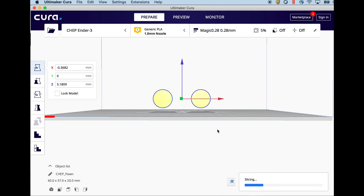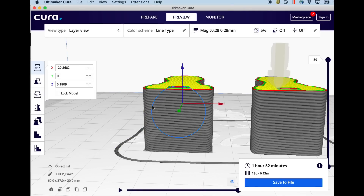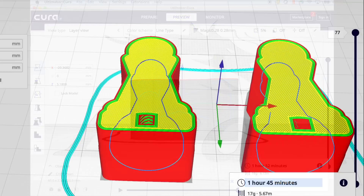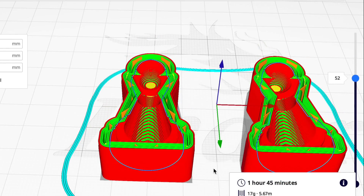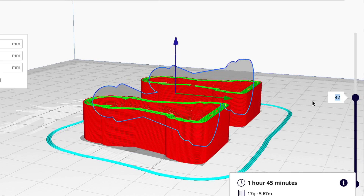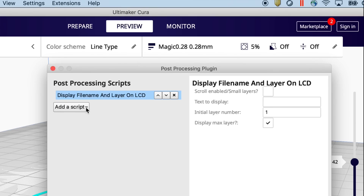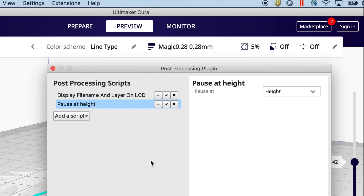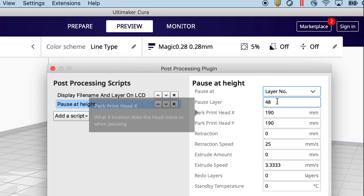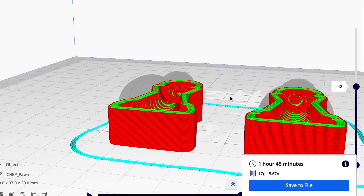Back to Cura — I'm going to take two pawns this time and do a slightly different method similar to what I did in Tinkercad. I'm going to change the mold angle setting to one degree so I end up with a straight edge. Putting the pawn on its side seems to work really well, and the corner is actually the midpoint of the pawn. I lowered down in the preview until I got to layer 42, and then I'm going to send a modify G-code script to pause at that layer number — the halfway point — so I end up with two halves.